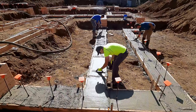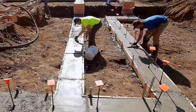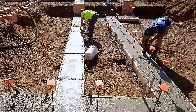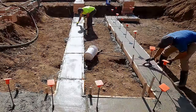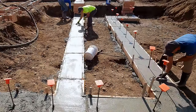Brian and Greg's job is just to float the top of the footings — they don't need to be perfect, we're not trying to polish them, it's all going to be hidden. However, we do want it flat enough to make it relatively easy to snap lines, set clips, and ultimately set our form panels without having them rock and roll. So they just keep a rhythm and make it look nice and flat.